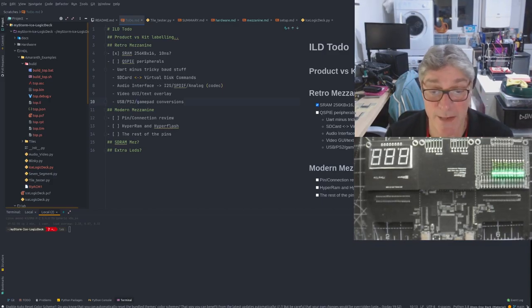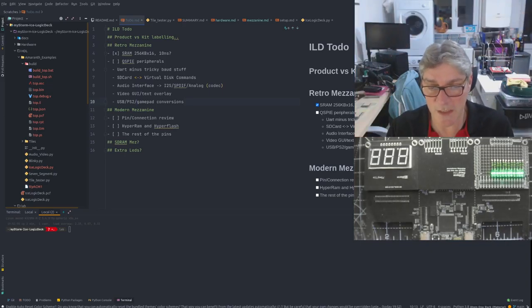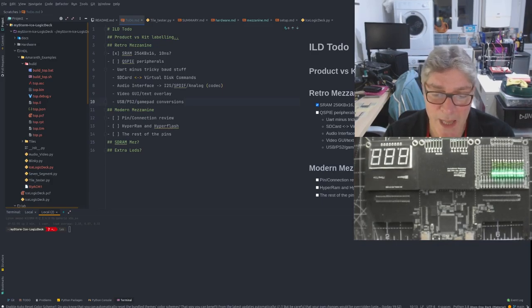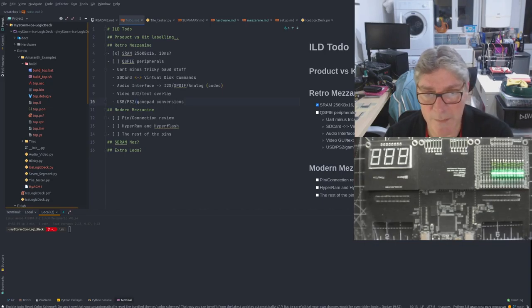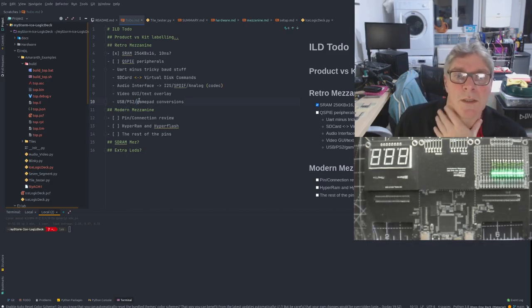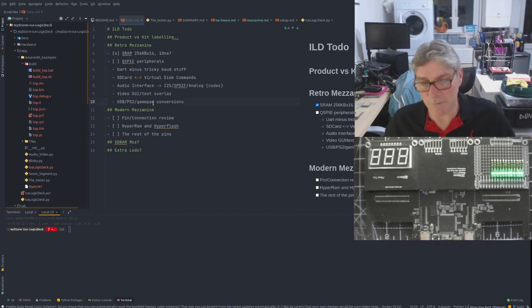So we have a choice. You could either have direct, you know, PS2 type simple interfaces connected to the FPGA themselves. Those could exist on, say, a tile. Or you could have those plug into the STM32. There is a spare USB that we could use to plug, say, a USB type device into it. You could even do PS2 on the STM32 if you want, and send commands that way. It's how far you take this and what you can do on the STM32 to offload what the FPGA needs to do.